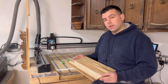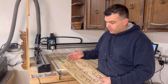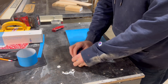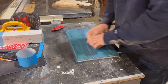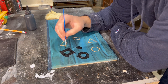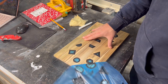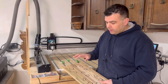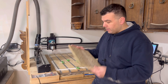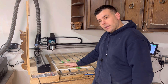Before carving the top and bottom covers, I thought it would be a good idea to carve shapes onto the other sides of the covers to indicate which shape goes into which side panel. To do this, I used an Oramask, a 90-degree V-bit to carve the shapes at about 0.1 inch depth, painted them, then removed the Oramask. This is totally optional, but the SVG file for these shapes will be included in the build plans.